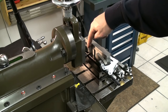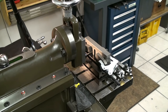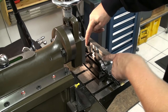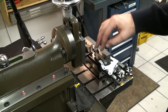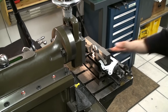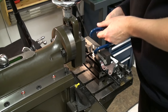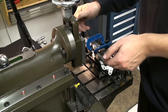I have two stops just clamped to the angle plate, left and right. To do the slotting, I take just one of the washers and drop it in and it's registered. It's aligned by those two stop blocks on the outside and by the riser block down here. It can move side to side and up or down, but not into the angle plate direction. I just take two C-clamps, which are plenty strong enough because the cutting forces are all directed into the angle plate.